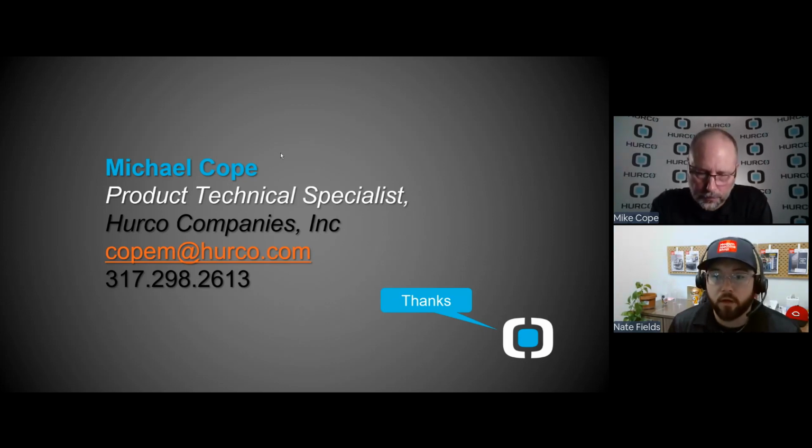Got it. And next up, are the rotary tables removable and can be placed back on when needed on a 3-axis table? Yes, they are. What we have to think about, though, is if you're going to put that on and off often, you're going to want to key it to the table, pin it, or something, because every time that comes on or off, we have to measure the center lines of rotation.